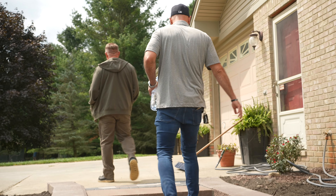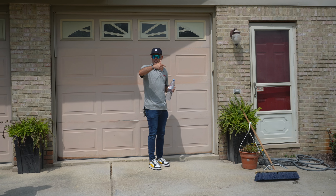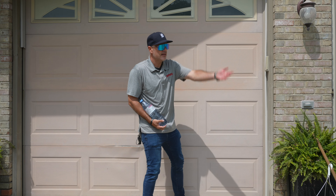This last step is kind of cool — it was set off the garage floor. If you notice, the garage floor is much higher than the driveway because the driveway has sunk. That's why we had to angle these pavers back rather than angling all the way down the stairs, so it's flush. When the driveway gets fixed he won't have to reset a step. All our guys from Stu to Louise — we run lasers to make sure we're accurate. Most guys would have never set it to this reference point, but we planned ahead so when it's fixed he doesn't have to rip everything down.